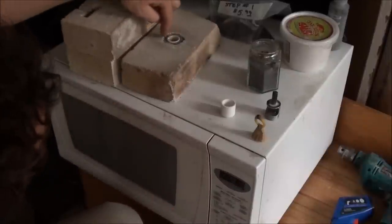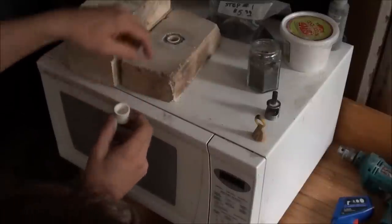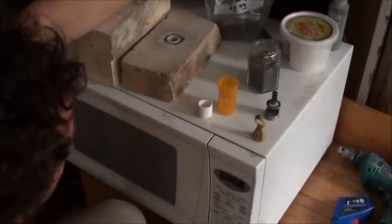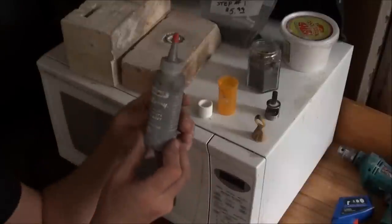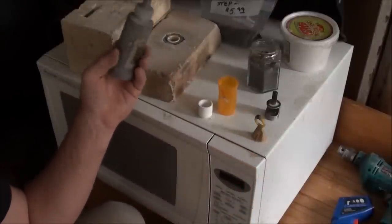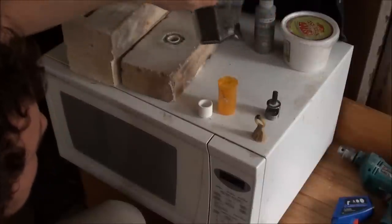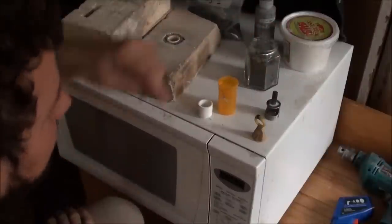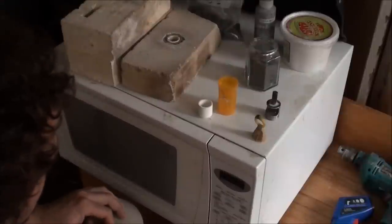This is all magnetite around the outside of this crucible, and there's probably about an inch or two of magnetite underneath it as well. Other materials people use are silicon carbide — this is what I got for a rock tumbler — and also dry graphite, like pencil lead type graphite from an art supply store. I mixed in a little graphite with my black sand, which I got from the river when I was panning for gold. Using a magnet I can get the magnetite out, and that's what this all is — magnetite — and I put that in here.